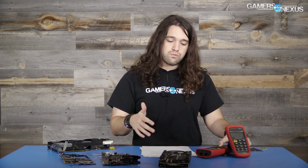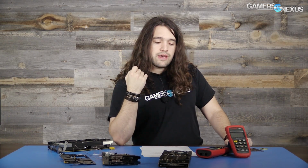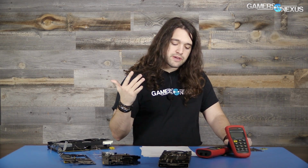Now, that said, obviously high temperature is not great. So it could be the case that you accelerate the death of the card caused by something else with high heat, but I still don't think that's the most likely cause. Regardless, if you have one of these now, you should still at least get the VBIOS update. It is installed through a double click and very easy, and your performance improves, at least thermally. And it's worth doing a thermal pad mod if you feel like you can, otherwise send it in or replace it with them, because the temperature improvement is just so great, it feels wrong to throw away a free improvement.